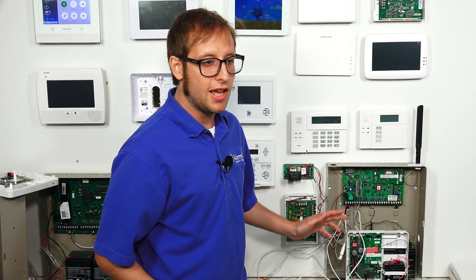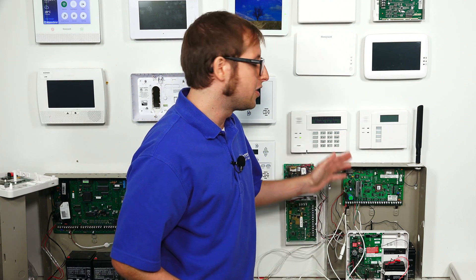If you get any troubles on your system upon boot up, you can clear them using your master code plus one — you'll get a chime to confirm the command went through. You will need to activate the communicator for alarm monitoring service, and this includes enabling the star 29 field in programming. We recommend waiting until your activation slot with your monitoring company, because otherwise you'll get a trouble condition on the system. Just know that when you activate the communicator, you will need to enable that star 29 field.